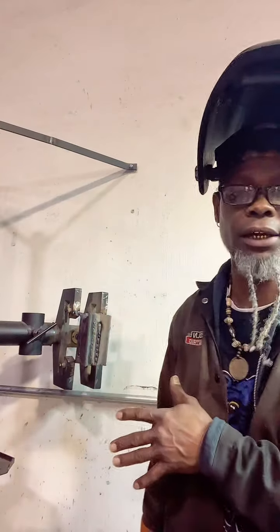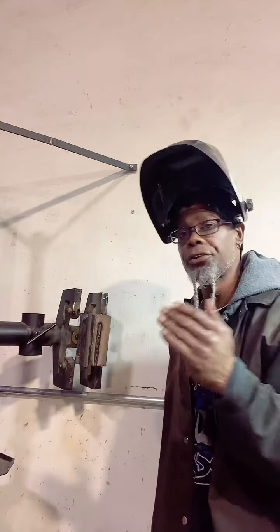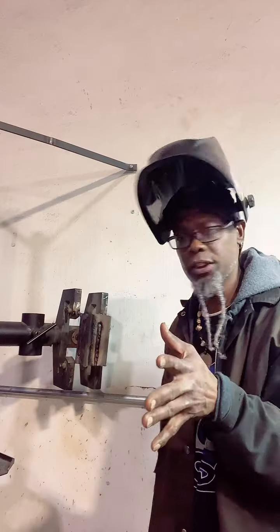The main thing, fam, I would say, I'm doing 7018 uphill now. The main thing I would say is to keep a tight arc, the travel speed, your angle, and make sure you're watching and preparing. When you're doing 3G, you're always preparing for your next weave. So watch the side, make sure you're tying in and burning into that backing strip, and watch the puddle so you won't put too much weld in.